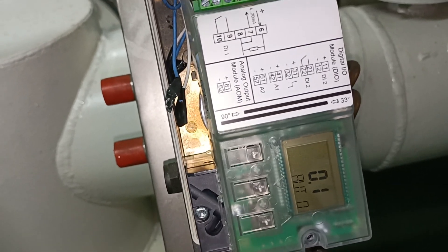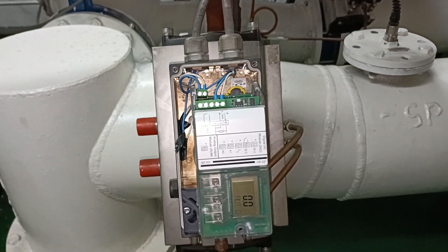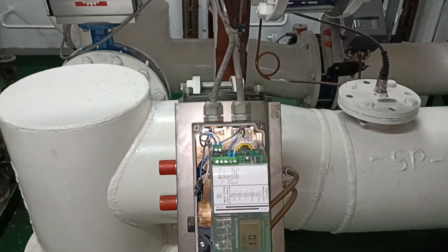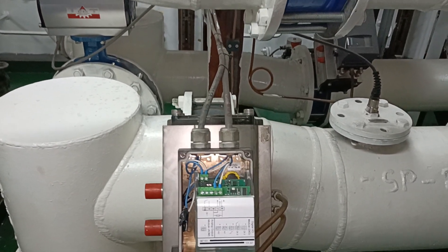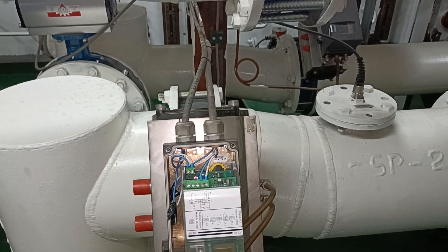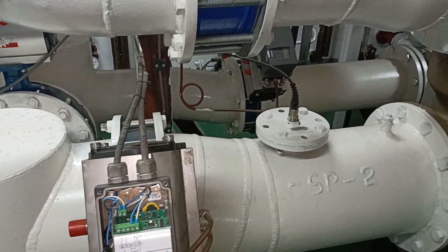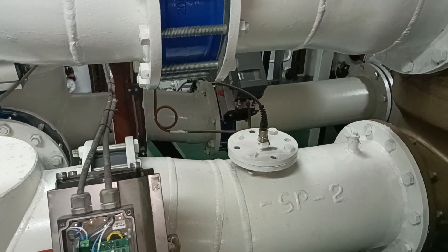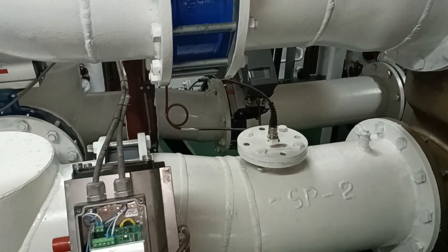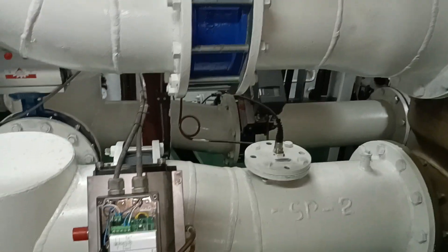It will automatically load. That is it — operation auto, manually operate this valve. But take note, don't use manual mode while the automatic mode is working functionally. Because this valve calculates the system flow meter of the seawater — it calculates how much seawater will go into the seal. So you don't need to manually operate this one.